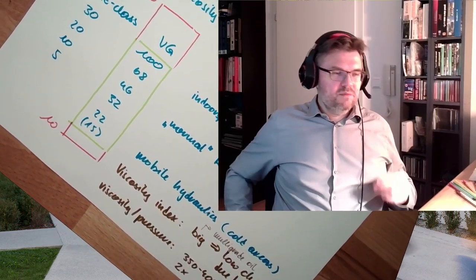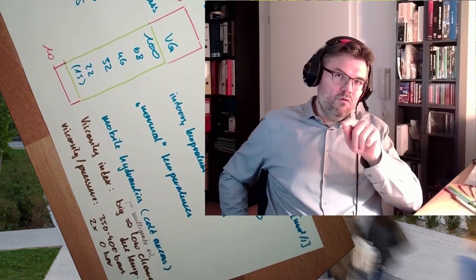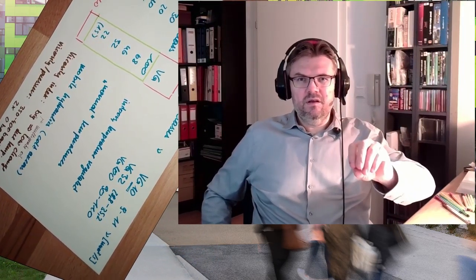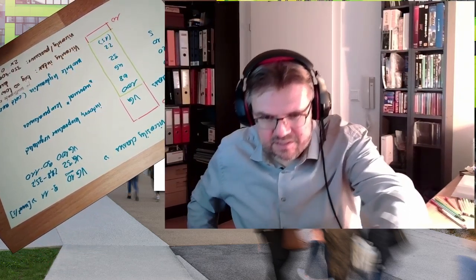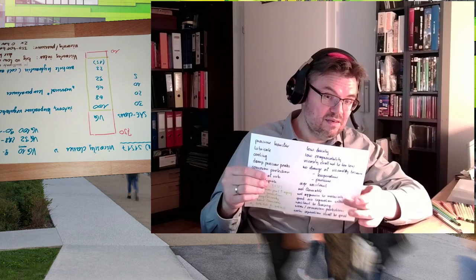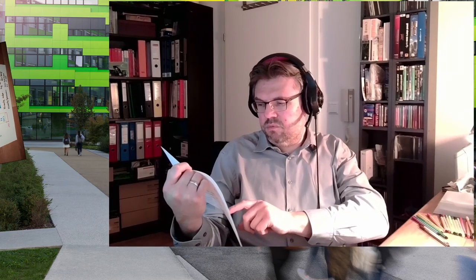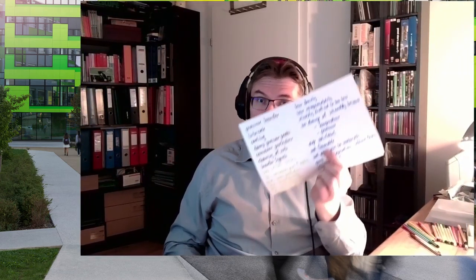So mainly it comes to the point to select the right fluid for your application. Like said, the fluid of use is usually hydraulic oil, because it fits our wish list best, let's say at the best price. It's rather easy. However, there's one big point where it's written, corrosion protection is good, not flammable. Oil is not non-flammable. Oil is flammable, especially if it's pressurized, and maybe there's a small pinch in a hose or something like this, and then oil mist is spraying out. You have a wonderful explosive area there.